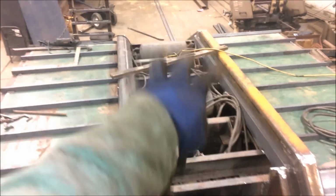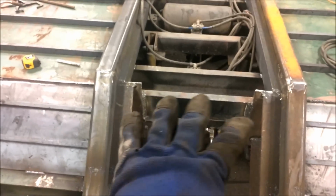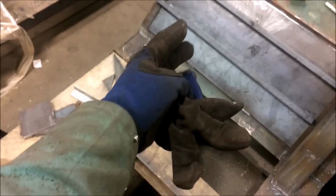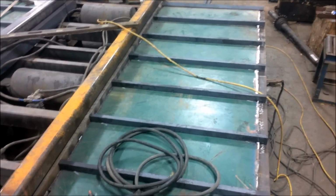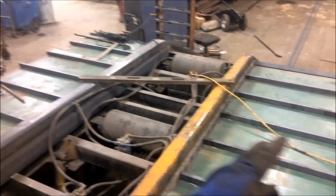A box van suspension's made for the weight to sit on top of it, but putting it on a lowboy, it's a cantilever type of strain. So that's where I went to modifying all this, battery's going dead. We went to modifying all this so it could take the strain from the front. And this was all rotten. This side had been bent down, all busted out underneath and leaned down for over 10 years. So we cut it all loose up there and pulled it up. Put new beams there, cut the whole thing off here, and then we made it solid. Crossbars matched every other track pad of our 700H. We took the center section and raised it up since it's 10 foot wide. The deck's 10 foot wide up over the suspension.